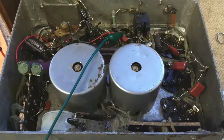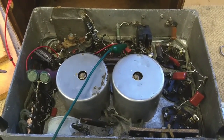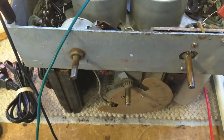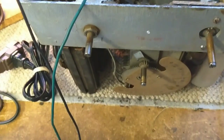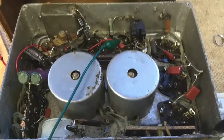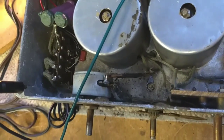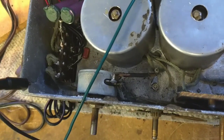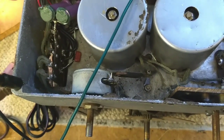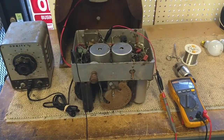I guess the next thing I could do is put it on a variac with a 1-amp fuse and give it the full 110 volts and see what happens. Just got to remember to stay away from that control — there's 180 volts on it right now. I should put one of the wooden knobs back on it so I don't zap myself. I'm guessing it's a screen voltage or something. Anyway, cool stuff. So here we go — we've got it set up monitoring our B voltage while I turn up the variac.